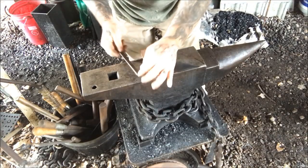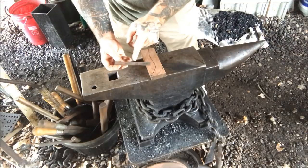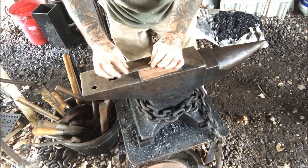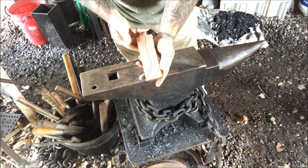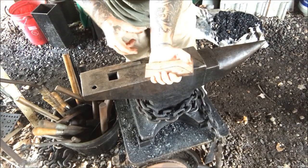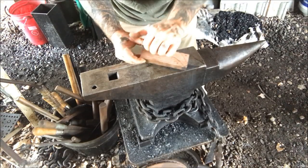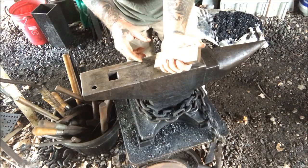Okay, so you can see what I've got here. I've got a piece of 1/8 inch 1095 here, and I've marked out tang here and blade here, and then we'll start to profile that in a minute. Then I've taken a piece of scrap walnut, reclaimed walnut, and I've drawn a handle shape on it that's going to be conducive to use upside down if I want to in a pulling motion, or I can also just grab it here. It's got a nice palm swell in it as well, to use it the other direction. But either way, this should become a very usable tool.